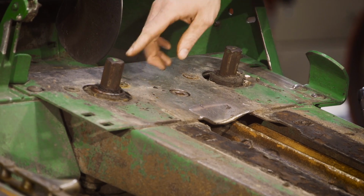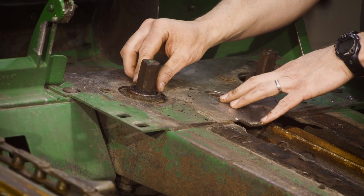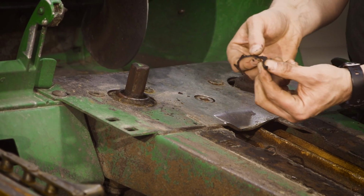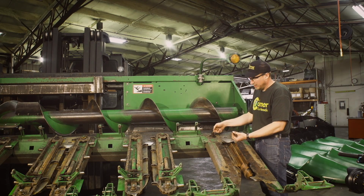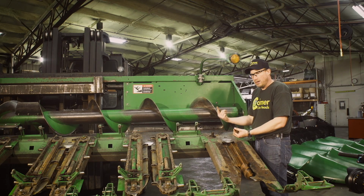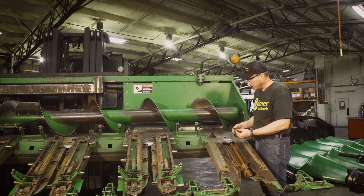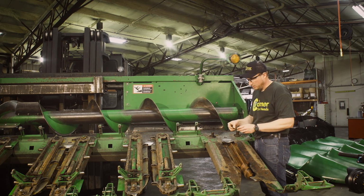on the top. A good way when we're inspecting the seal is like this one right here needs to be replaced. You can see there's debris here, and it's wet with grease. You can see it's wet. That means that seal is leaking. There's a spring on that shaft that augers grease up the shaft to the bushing to keep it lubricated. The seal's supposed to hold the grease in, obviously, and you can see it is leaking.